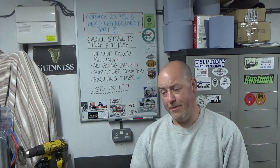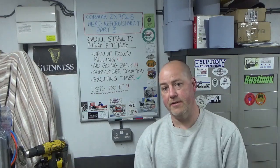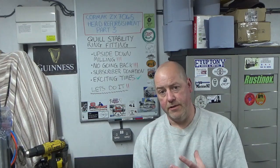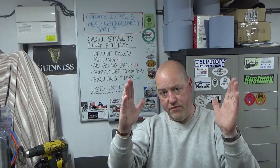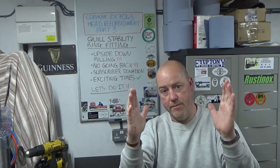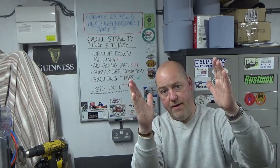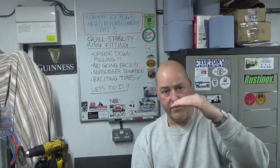So in this video we're going to be setting the mill up. We're going to be going through quite a lot of settings and checks and things like that. And the first thing I'm going to do before I remove the old spindle is tram my head with that spindle in it to make sure I've got my head trammed as best as I can possibly get it, because I'm going to be machining the underface. So obviously if my head's out of tram, I'm going to end up machining the underface in an unparalleled or unsquare condition to the spindle axis.